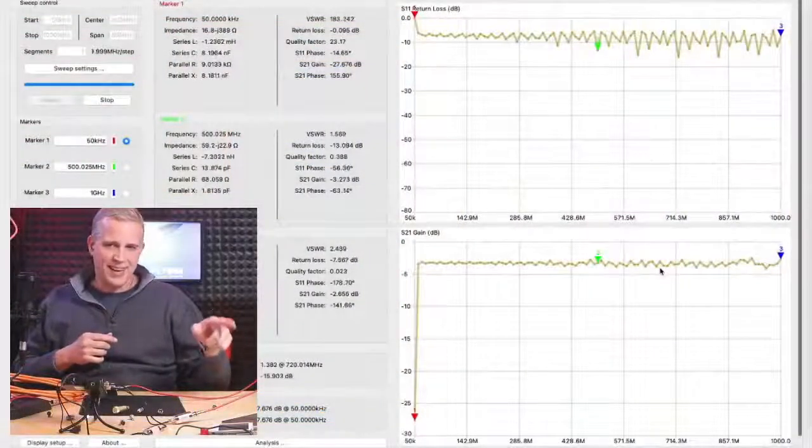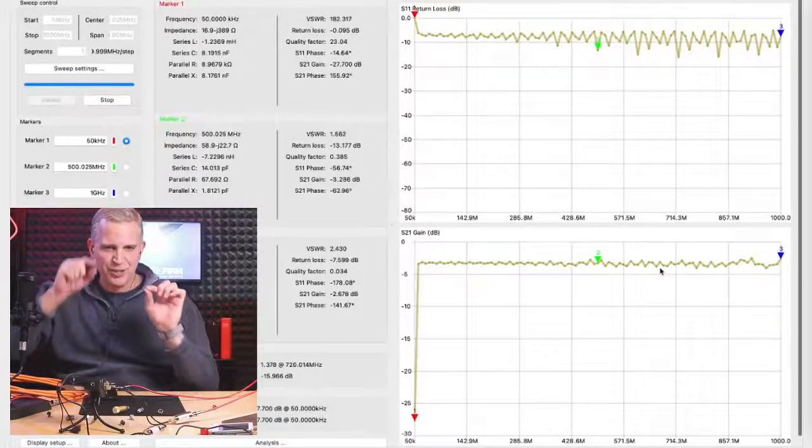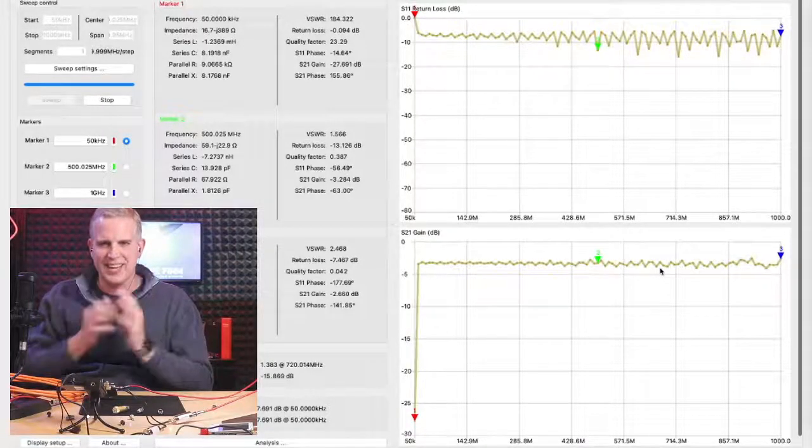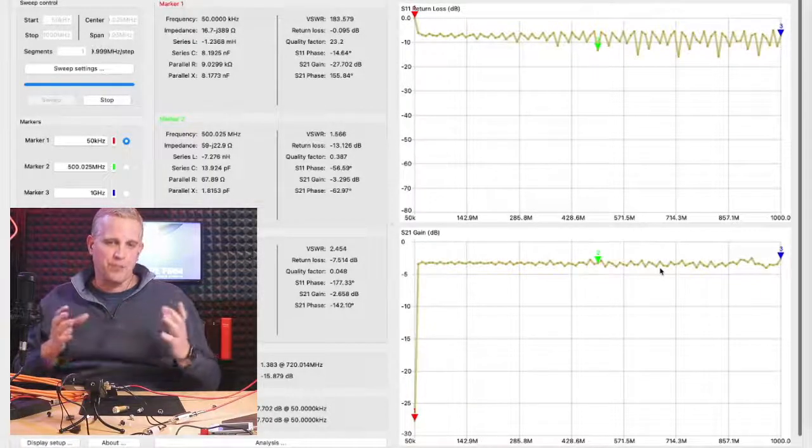It's about 6 feet long. Now I hooked on a piece of orange coax cable here, which, maybe this is running to another room. This is about 20 foot long. If we look back at our overhead here, remember before there was a standing wave that looked kind of long, but now looking back at the overhead, we can see we have a standing wave that has a much higher frequency. I call it tighter ringing, right?